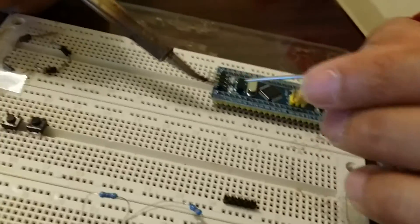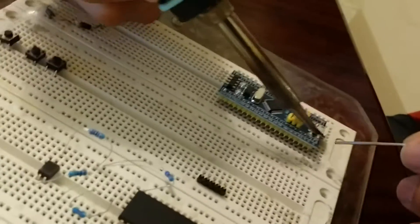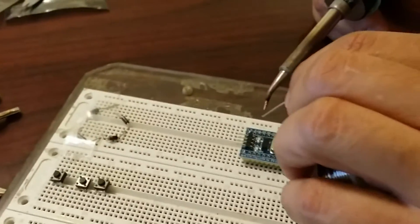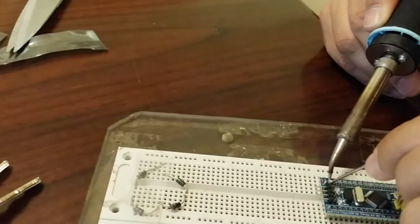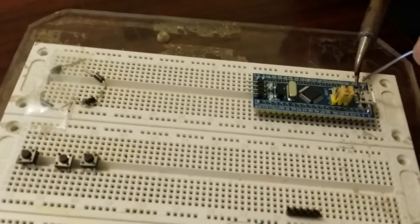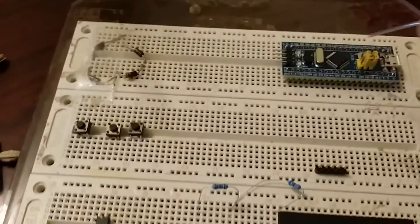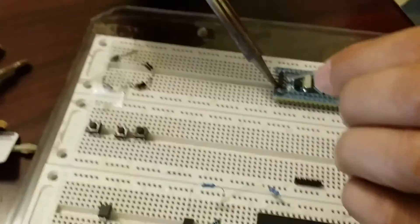I'm doing the far away places first so that the heat doesn't damage adjacent components. I leave the soldering iron long enough for the metal to actually melt. Once it does, I just lift it and move to the one that's far away, and I keep doing it over and over.